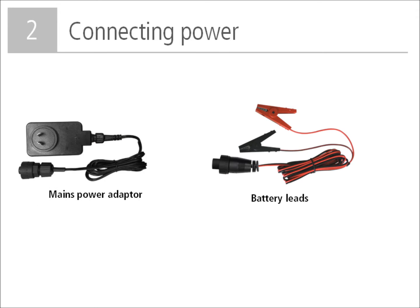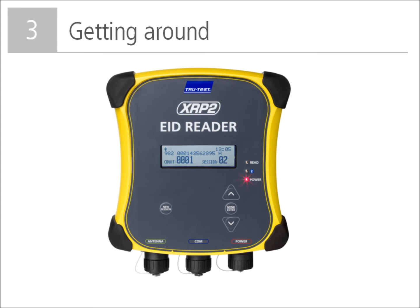The panel reader can be powered by a 12-volt battery using the supplied battery leads. Connect the red clip to the positive terminal on the battery and the black clip to the negative terminal. Alternatively, the panel reader may be powered by mains power using the mains power adapter. There is no on-off switch. When power is applied, the unit will automatically switch on and the red power LED will illuminate.